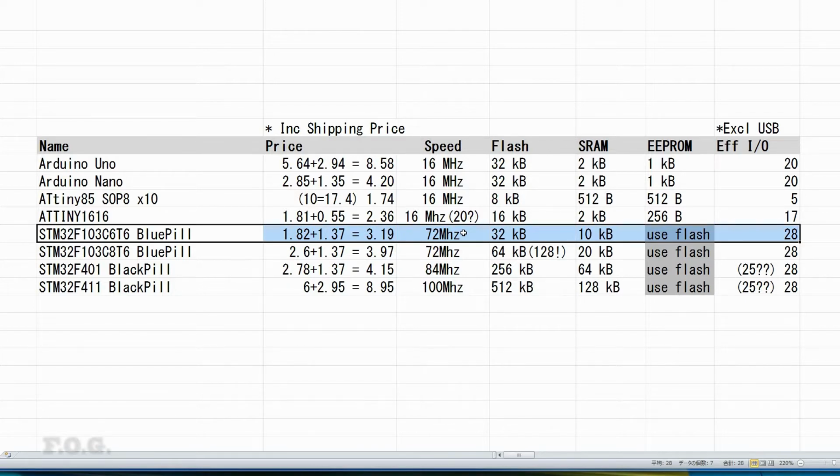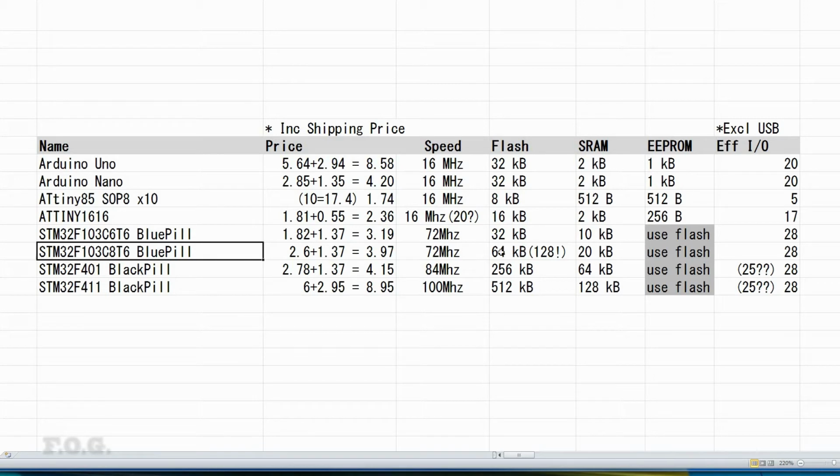I can put a realistic aspect to that: after just doing the experimenting, setting up the IOs and not really doing any user interface or anything with my mini lathe, the 8T6 version of the chip, which has 64 kilobytes noted capacity, actually I ran out of space. I was going to be forced to go to the black pill straight away. And it was only that I'd read an article online and noticed that the 8T6 is actually built in such a way that, when they were manufacturing, they manufactured it with two 64K blocks, and then depending on whether one of the blocks was bad, they would only enable one or the other of the blocks. So effectively these had 128 kilobytes off the bat, and if I understand correctly, the yield rate ended up being much higher than expected. So actually all of these 8T6 chips have effectively 128 kilobytes of flash memory.